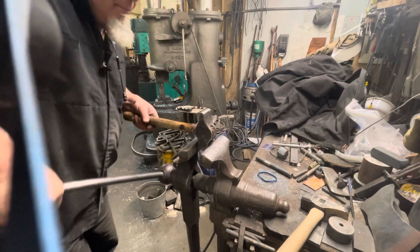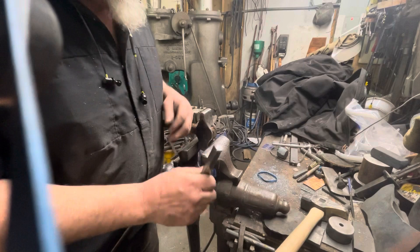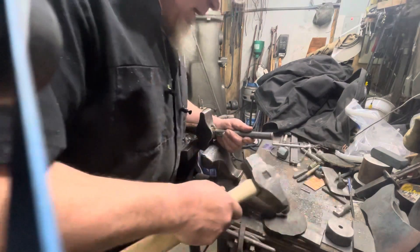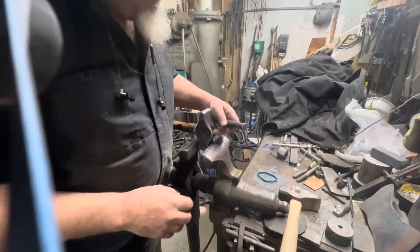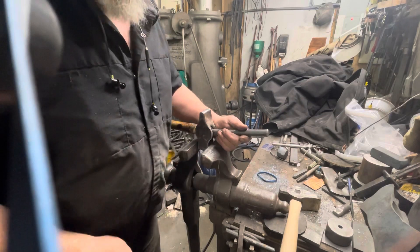The way that I do that is make a simple little mild steel tool that's roughly the same size as the hammer handle material. And with some smooth blows over the surface of the whole thing, I'll drive the handle from it.